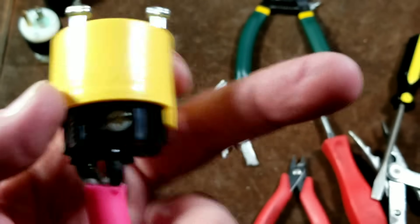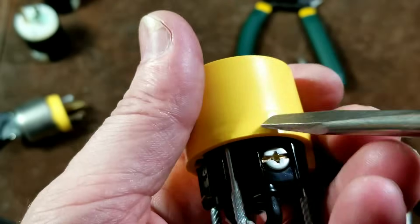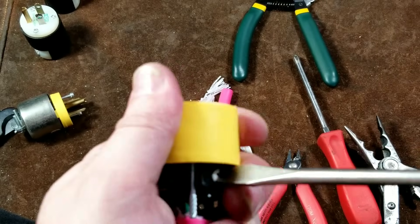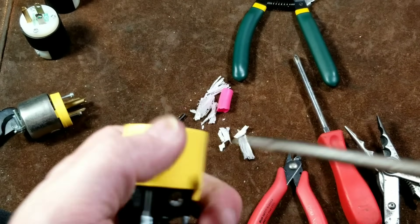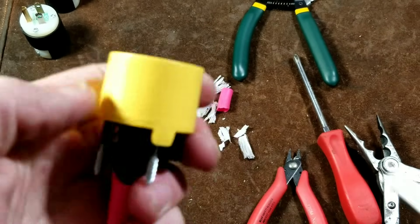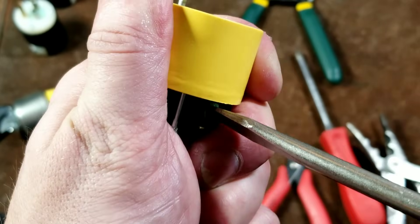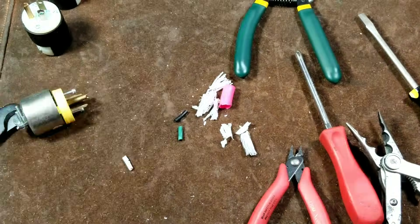You don't want to leave it quite like that — these actually need to be surprisingly tight. But you can tell you have a good job because it's close and the insulation is nicely inset in there. Now we'll use the slot head screwdriver to really get plenty of force on these connectors. All these screws I've ever seen are both Phillips and slot head. One nice advantage of slot head is when you need to apply a lot of force to a fastener, it's far better than a Phillips because of just a straight slot. I'm able to easily get all the torque I need — no worries about the quality of these connections.